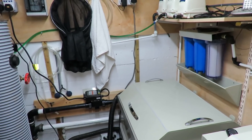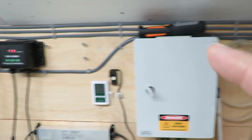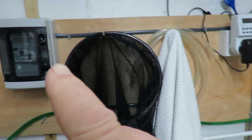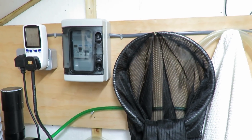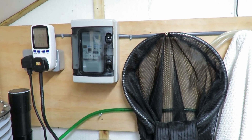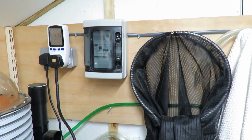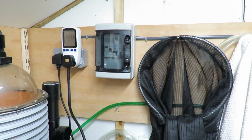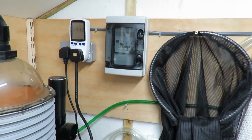In the filter house itself I've got everything connected - the wiring is all in, I've gone four mil all the way around to the actual breaker box. A lot of people ask why I need a breaker box on these heaters - you don't have to add one at all. These heaters are slow-start and will run off a normal 13-amp plug, so you don't get the power surge when it strikes up.